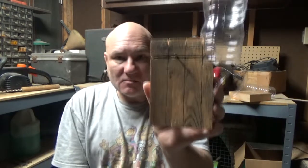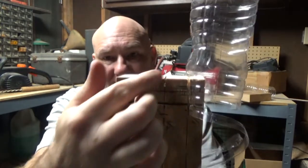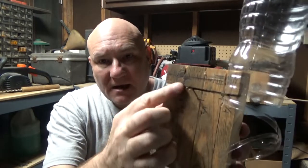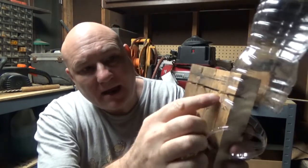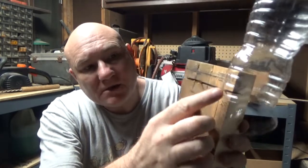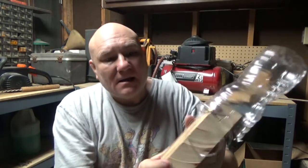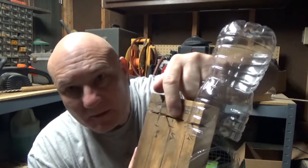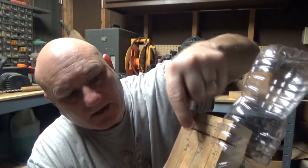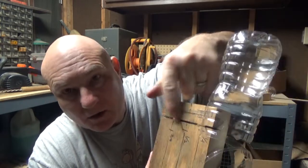It's a square piece of wood, as you can see. Basically, I've taken 3 notches down. They're 1 inch apart, and 1 inch down I went across. Right now I have a razor blade inside here, and I'm holding it together with just 2 nails, which is keeping it in there. And depending on how far down from the razor blade that you make your notches, this one is 1/4 of an inch, this one's 1/2 an inch, and this one is 3/4 of an inch cut down below the razor blade.